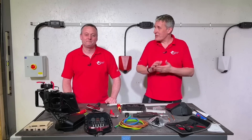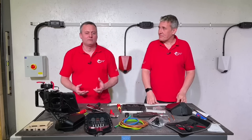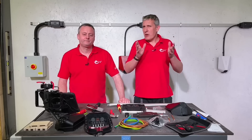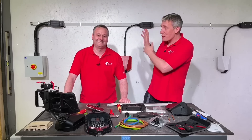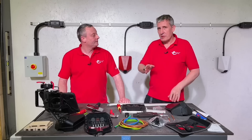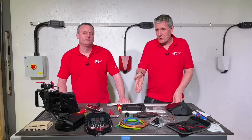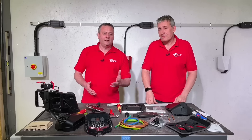Even with a knife, that's probably the most difficult part about the entire installation, and it wasn't difficult. We've been bouncing ideas around about what else to consider. In car parks, especially with long cable runs — Easy allows up to 100 chargers on a system — we think voltage drop is probably going to be the limiting factor on the application. Put your thoughts below, and any regulation-related questions, because we should look in detail at the continuity you can get between those screw connectors and the bus bar cable, and possibly the insulation resistance as well.